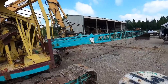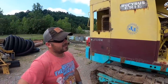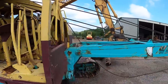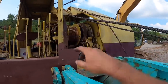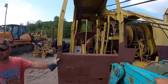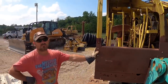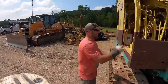All right, man, behind the scenes, after a whole bunch of back and forth, round and round and up and down and crossing over, I think we followed our picture. We've actually got it in the hoist drum over here, which is that one over there. We got the wedge in. I say let's fire it up, put a couple wraps on the drum, then we'll cut the cable off and dead man it off. And then you can raise it up. We'll see. That'll be the hope.